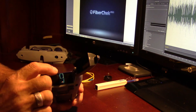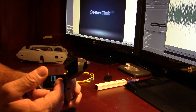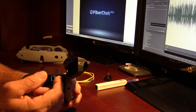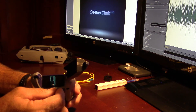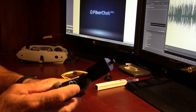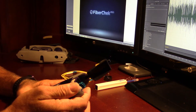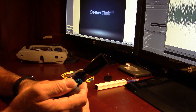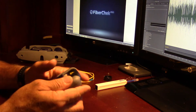It's not a quick change — you actually have to undo the two screws and gently take this out. There's an FC connector under here. You unscrew that and then put in your new adapter. So that is changeable. I just go ahead and use an LC to SC or LC to APC jumper if I need to do any kind of adaption.